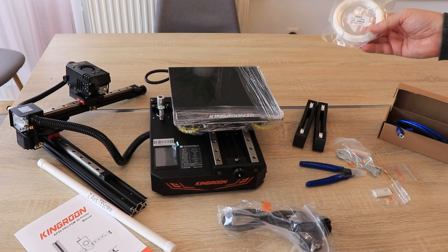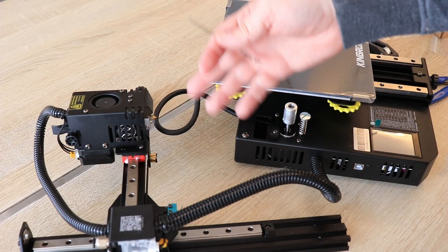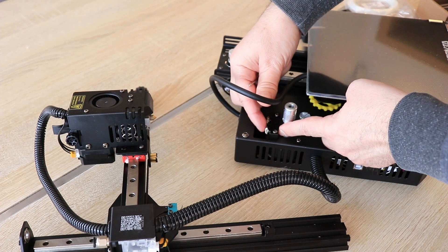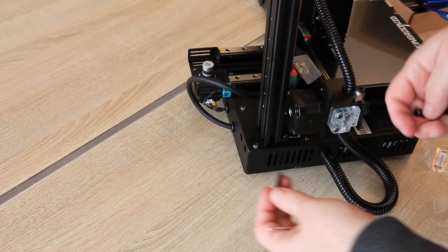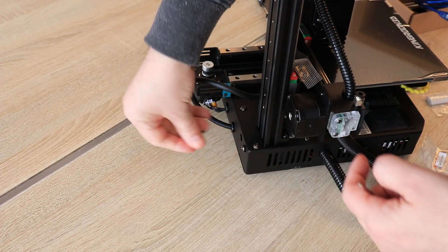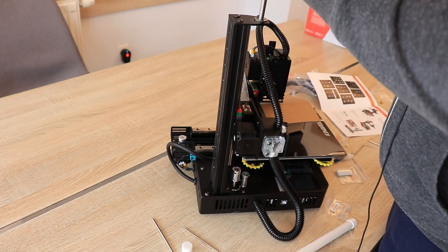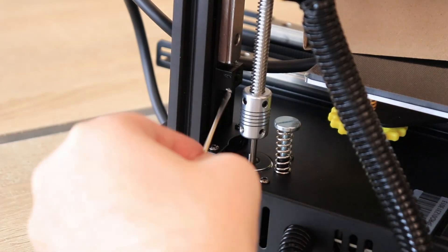I'm not even sure how I can use this sample filament with this spool holder. The Z-axis installation is the same — first preparing these T-nuts, then two longer bolts from the back side. There are also two smaller M5 screws from the bottom, which I noticed later.